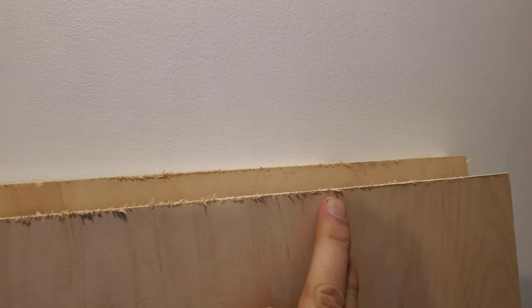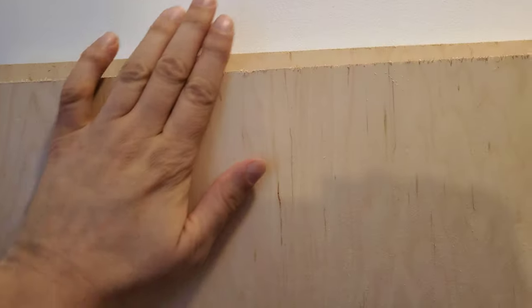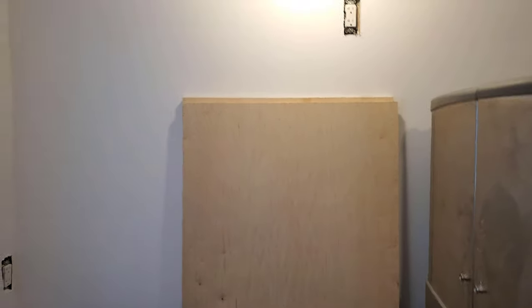This is the quality of cut I've been able to get with the circular saws I currently own, and that's kind of disappointing, particularly where these sides are going to be visible. The other issue is that with the skill saw, which is really really old, it's virtually impossible to cut a proper 90 degrees — it always seems to flex at the foot. So in order to overcome these two problems — the tearout and the non-90-degree blade angle — I invested in yet another tool.